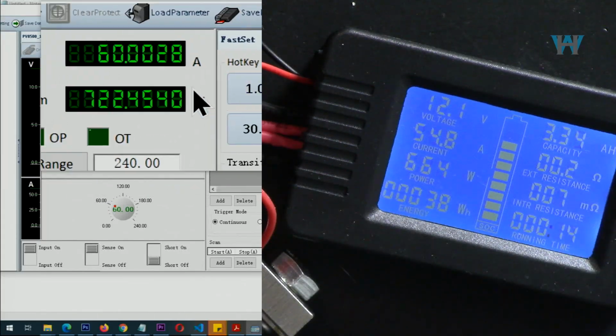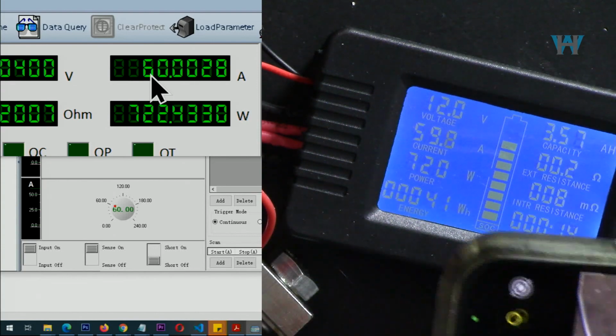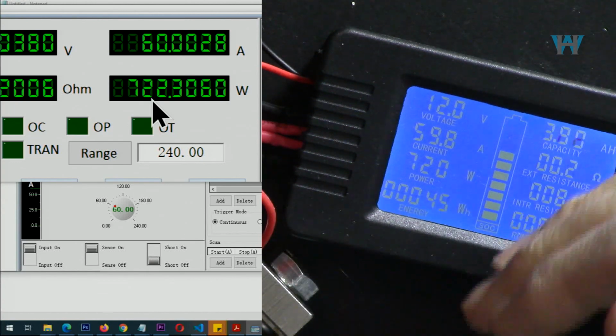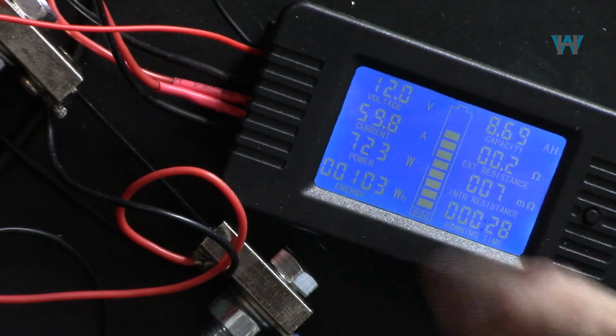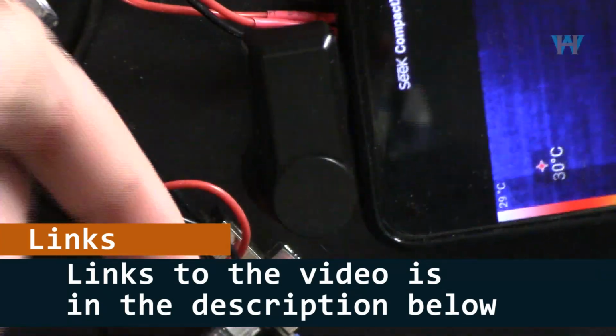Now let's go 60 ampere. Now we are drawing 60 ampere. 722 watts, and here it shows 720, only 2 watts deviation. It seems when we increase the current, this became more accurate. The ampere is being drawn from this shunt. I'm using a thermal camera. The link for this camera is below the video in the description. So let's have a look at this and see how hot this is.